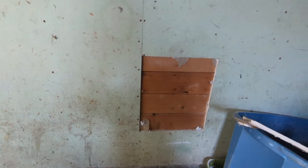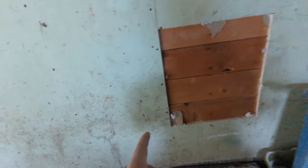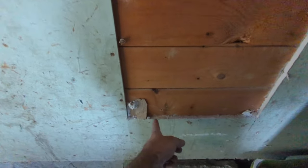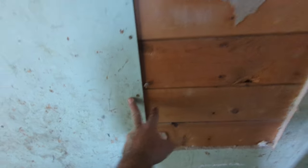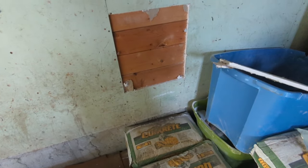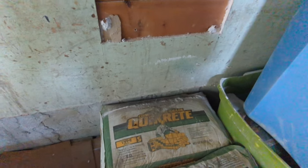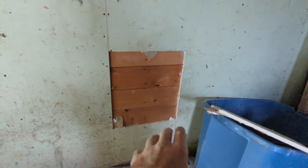Here's a case of assuming that they hadn't done this right and hadn't sheathed the house before putting drywall on, because we are in the garage. But in fact, they have sheathed it, and at this era, they would have used boards, which is what we've got here. So I was excited after the drill came out that this is probably where the stud layout was, because it was a split between two sheets of drywall. Actually, that's the full width of a sheet as soon as they set it to the edge of this door. 4 feet put you there, and they can nail into the edges of it anywhere on these boards. So long story short, this is the layout stud that's just right next to our hole inside. So 16 inches from there is where we need to take at least this lower board out to be able to try and drill. We'll probably have to take two out. And so this ends up being an extra amount of drywall that didn't need to be taken away over to this side here. We need to have more there.